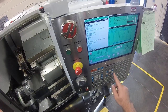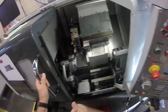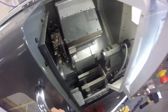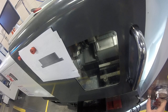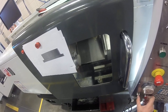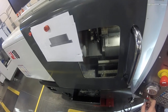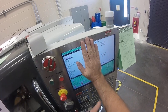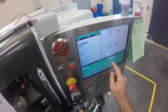I've got some of my offsets backed off right now — my work offsets. That would be the original offset, and this is a hundredth out to the right. I'm just going to machine some of it off, and I believe I'm going to put a little detail on the front. For now, I just want to get rid of the material. In my program, even though I'm down there, I program it so it goes home before it does anything. I like working out my work offsets so I can use the big page of offset systems to see where I'm actually going.